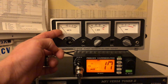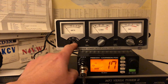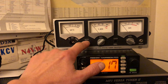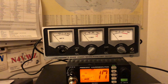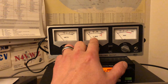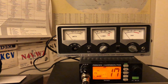It's got a watt meter here — average power from 5 to 500 watts. It's missing the knob but a flat-head screwdriver works just fine. This is why I got it: it has the modulation meter which I've already calibrated. It's missing the switch for SWR and calibrate, but you can get in there and do it, which I've already done. The SWR meter works just fine, modulation works great, and the average power watt meter works as well.